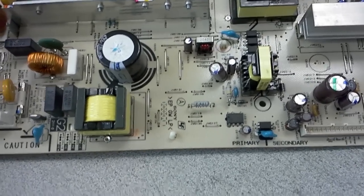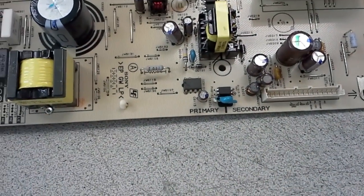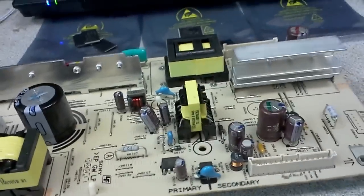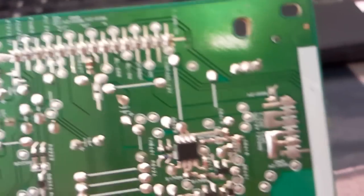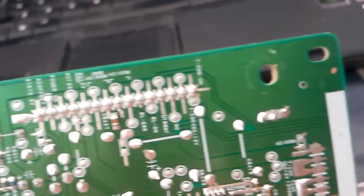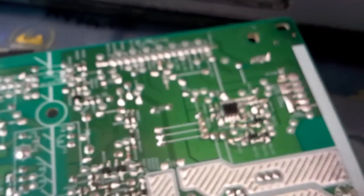command to no avail. That is, the board does have standby power, which can be measured as 3.3 volts on this connector. That would be the very first pin here. You can see 3.3 volts. So if you measure between that pin and ground, which is most commonly the track connecting with the metal chassis, or you can pick ground on the connector itself. This would be ground. You can find ground here on one of the labels. All those pins will be ground. So there is 3.3 volts.